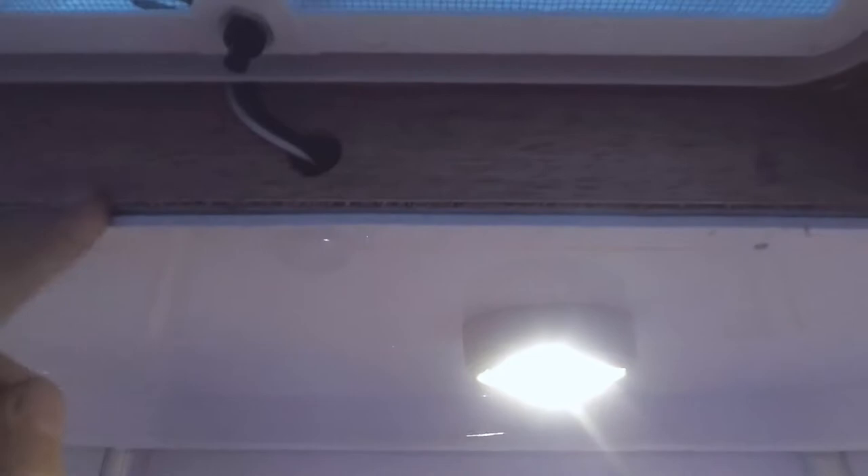With this plastic moulding in place, it's actually a bit big for the existing opening. So I'm going to use these holes as a reference, mark it, and then drill the holes through. Just to show you what we've got to drill through — it's about 4mm thick polycarbonate, part of the shower recess. So I need to drill through that. I've marked these four holes and I'll just drill them as a pilot through the polycarbonate, then we'll screw it up.